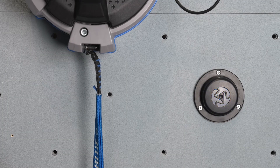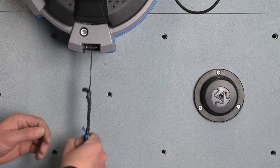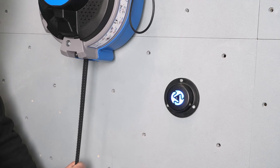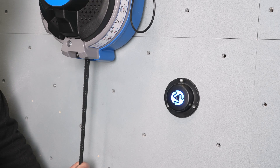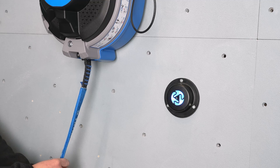We've installed our IQ Plus and set the hold time. Now we're going to run a quick safety check — this is a great routine to follow each time you recharge the battery. Activate catch-and-hold mode by pressing the base button so the light is pulsing blue. Gently pull out a few feet of webbing, then pull down hard to simulate a fall. The IQ Plus should immediately enter hold mode. You can tell it's working when the webbing locks into place and the button switches to solid blue. When you let go of the webbing, the IQ Plus should sense the upward movement and release — you can tell it's working when the blue light begins pulsing again.